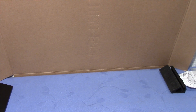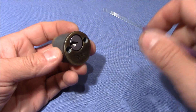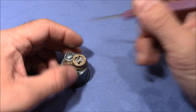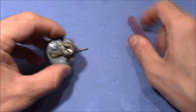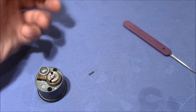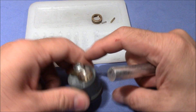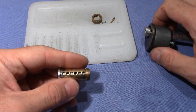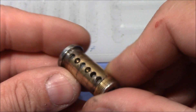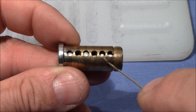Now let's look at what's inside — pretty curious. I don't have a key so I cannot lock it back up. I turn it like this to get off this back ring here. Usually there's a spring; now it's attached to the retaining pin. So we've got the pinning tray here. I need a follower — here we go. Pins are pointing upwards, everything should be fine. Here's the plug. All six chambers are populated and we can see pretty good bitting, with long keypins in one, three, and five, and the other ones are very short.